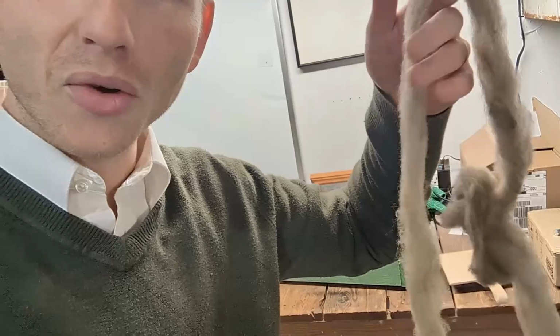The fiber in its preparation, the way that it was used in his spinning frame, which is the machine that actually spun the thread, what went into that machine is called sliver. It is a long, thin length of prepared fiber that looks a little bit like this. And you have to have big spools of it, pre-combed and ready to go. I don't know exactly what machine he was using. I know what came after when carding mills developed, but I want to learn more about what developed before that. Another thing that I'm curious about is in the very first inventions of these carding machines, they're called needle sticks. And I had an idea for how to replicate something like that.